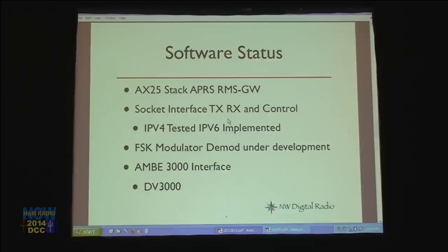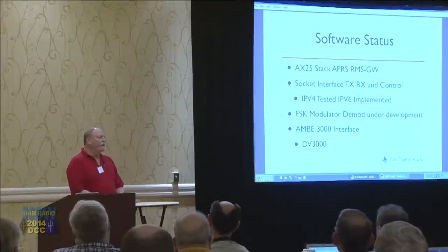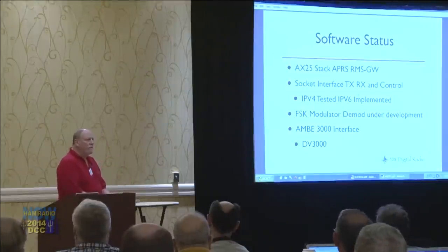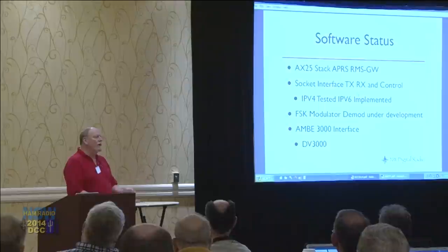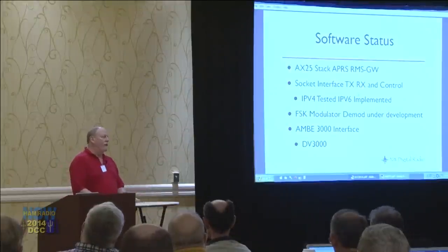The FSK modulator DSP code is done — the modulator section is complete, and changing baud rates is relatively straightforward. The demodulator is still under development because we're doing something different: your standard demodulator is non-coherent, meaning the receiver has no notion of the actual inbound carrier frequency. We've done that, but we're also building a fully coherent demodulator for gains in Eb/N0. Most ham radios are 3 to 6 dB off from theoretical; commercial gear gets under 2 dB. We're trying to bring that number down, which requires coherent demodulation.